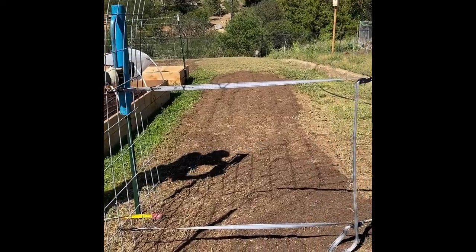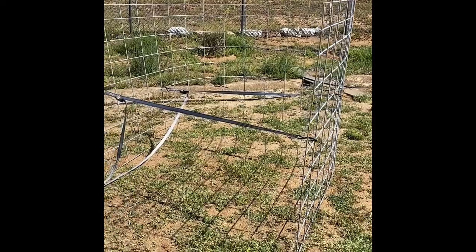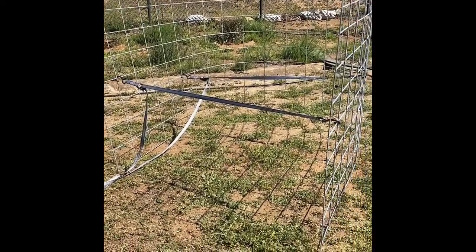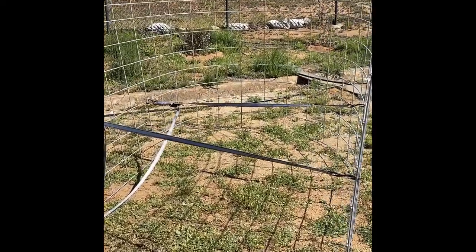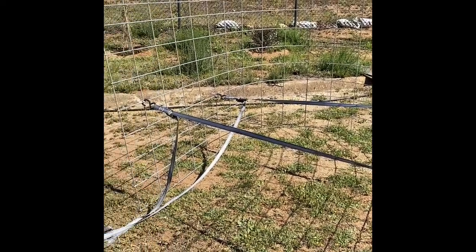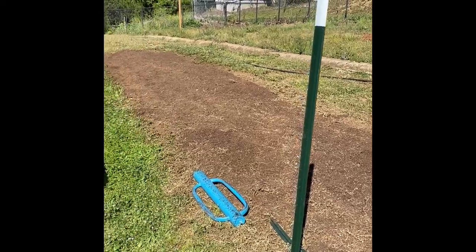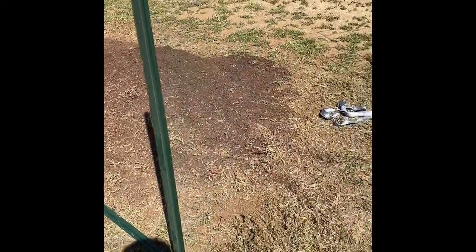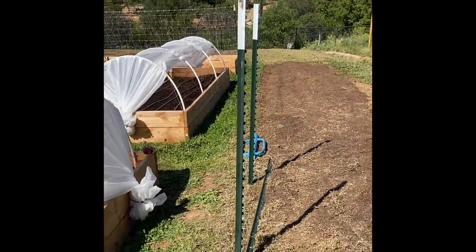It's hard. So here's an example of what it looks like when it's down. Just grab one end, put the tie down on it, grab the other end. Measure it out to 5 feet. It gives you good height underneath it. And you can just let it sit there. Easy to pick up, even by one person, while you are slamming your post in. So we're gonna get some string line, put it on the front post, so that we can ensure that all of our posts are gonna line up.